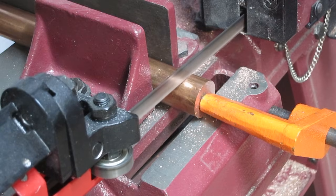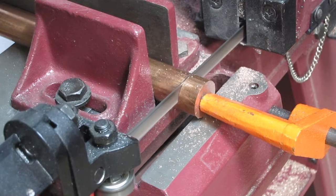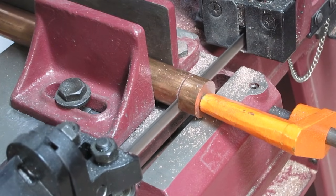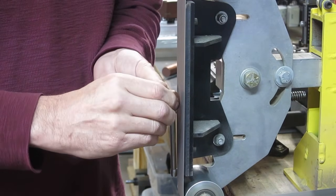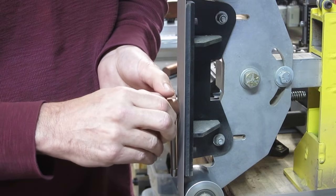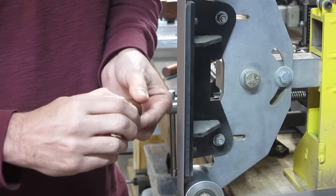These are cut to exactly 0.49 inches in length. After that, just like I did with the bodies, I clean up the burrs around the edges so that it fits into the fixture properly — no burrs hanging on the bottom that will stop it from laying flat. Now that I have the round bar cut into smaller sections, I machine this into a button. Just like before, there are two operations: one on the top and one on the bottom.